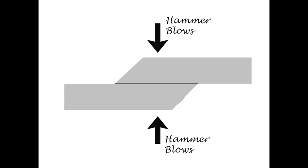If we put a slight slope on the ends of our bar, then as we hit, everything is in a welding plane — nothing's in a shear plane. So now the two surfaces will go together forming a diagonal weld.